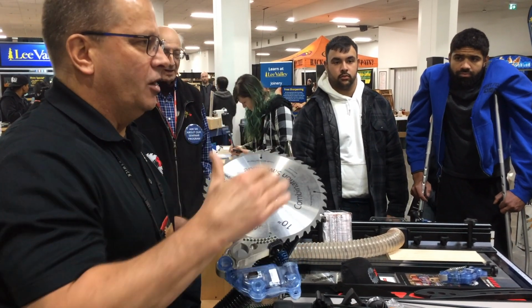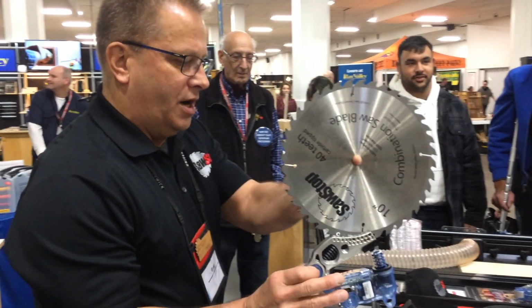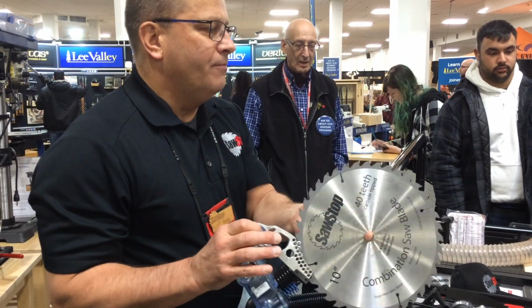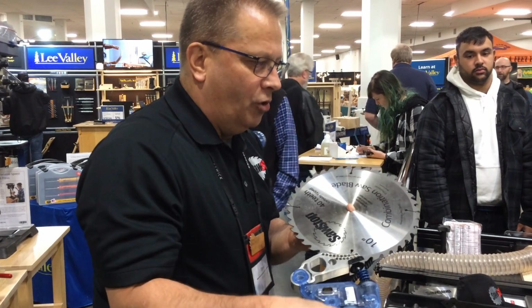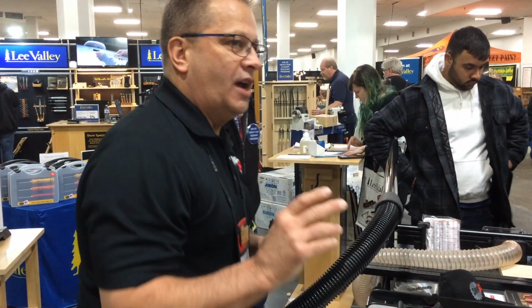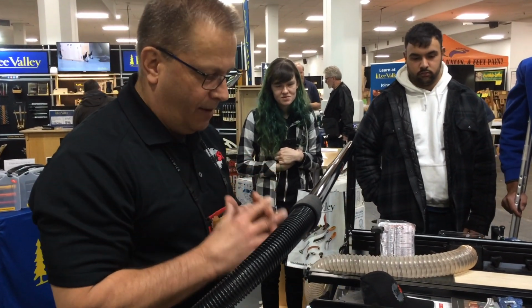But there's so much angular momentum on the blade that momentum is redirected and used to release the trunnion, and the blade drops down beneath the surface of the table. That process, the dance, detecting contact, stopping and dropping below the table, in total it takes 5 milliseconds, 5 thousandths of a second. The safest way to dance with a table saw blade is with a SawStop.